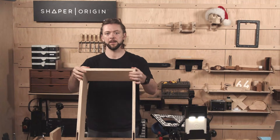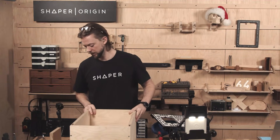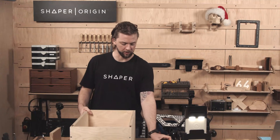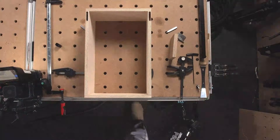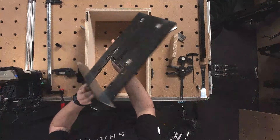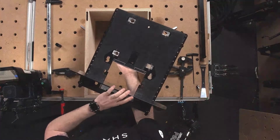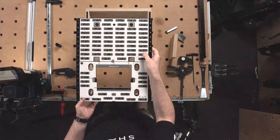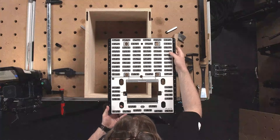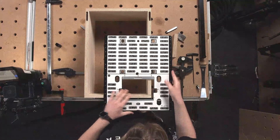I have my case here and I'm putting my two hinges right along these rails. First things first, I'm going to make sure that my case is securely attached. Then I'm going to grab my plate with the addition of the edge mortising adapter. I have this set in the lowest setting. I'm going to deploy my right flags and press firmly against those flags and firmly up against that edge mortising adapter.